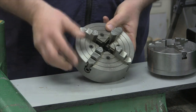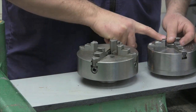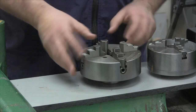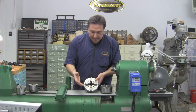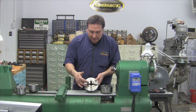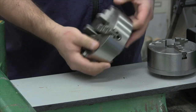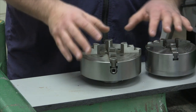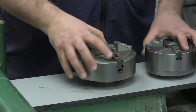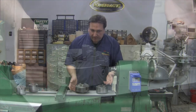What if you add more jaws? Here's another chuck called a four-jaw chuck. This is not a scroll chuck — scroll meaning one key and the jaws move out in unison. This is a metalworking independent four-jaw chuck. It's designed for holding odd-shaped pieces — rectangular, square, eight-sided — so all of these jaws can move in and out separately to clamp down on an irregular piece. Each jaw is controlled individually. Very precise, very accurate, but it doesn't provide enough holding power for woodturning, and is also very time-consuming to set up.